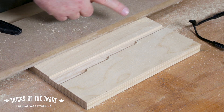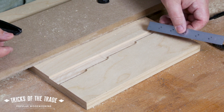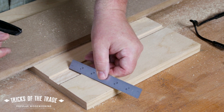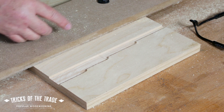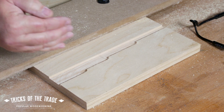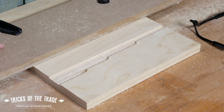And there you go. We can see the progression of the width as we turn the base to a different side. We've got a half inch to begin with the long piece, then three quarters, one inch, and inch and a quarter, just by turning the base. And you don't have to do this just to widen out — you could use this as a reference point, saying you need one piece that's a half an inch, turn it all the way, and you've got it offset by a half an inch. A very cool router trick — one I'm going to use in my shop, and one I think you'll find a place for in yours. Until next time, we'll show you more great shop tips from Popwood.